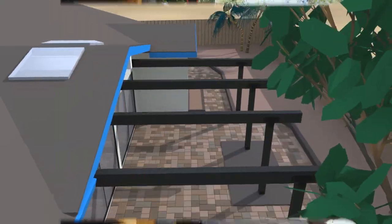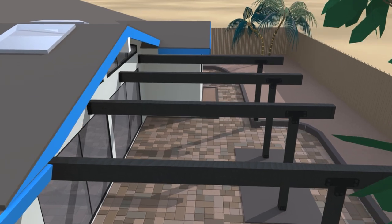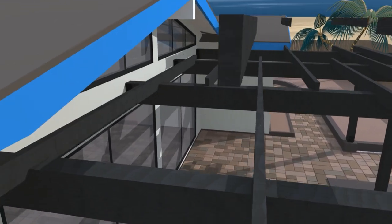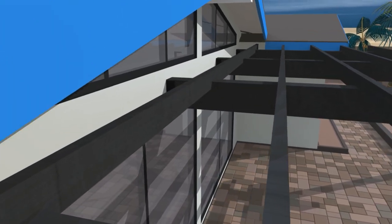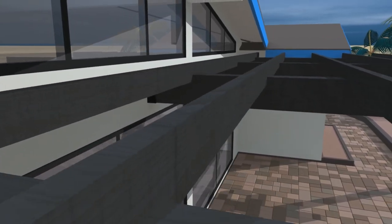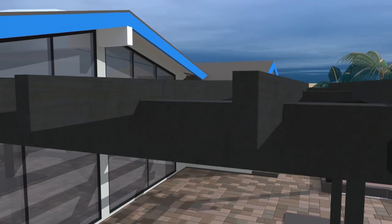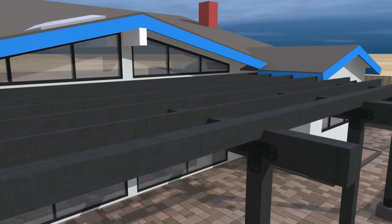The design of the pergola has 2x6 cross beams spanning 24 feet. I'll achieve this by staggering 16-foot and 8-foot pieces every 2 feet, starting with the first crossbeam 1 foot from the house. At the end above the post will be 2 6x6s spanning the 24-foot distance.